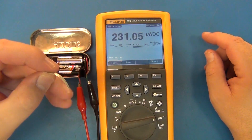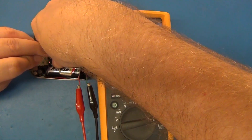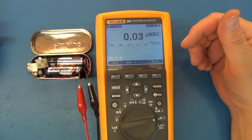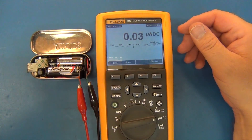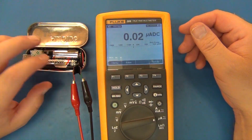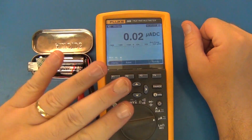I'm going to stick the paper in now and show that it does break the circuit. I'll back off one of these batteries and shove it in there — and that drops down to not 200, but 0.04 microamps. So essentially zero. That's how you keep your MintyBoost from burning up your batteries. I hope you enjoyed — thumbs up if you liked it, quick tip, and thanks for joining.